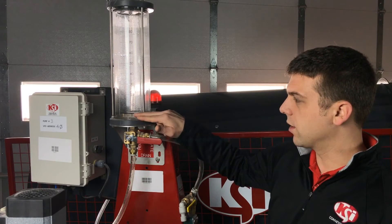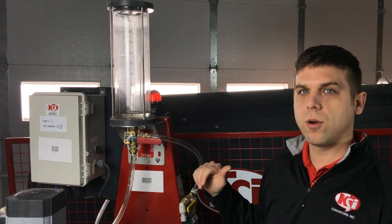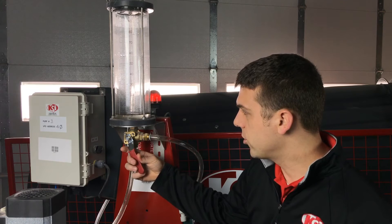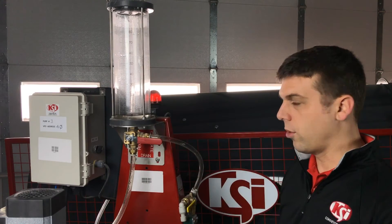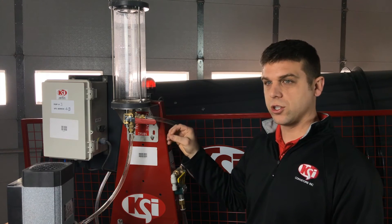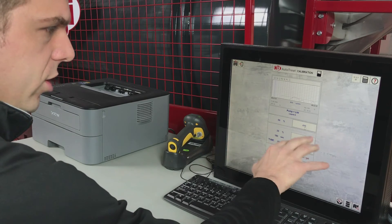On the calibration tube, you can see the liquid is just a little bit above the zero mark. We want to slowly drain that liquid back out of the tube and then put the valve back into calibrate. At this point we're ready to actually run our calibration procedure by pressing start on the touchscreen — we can see the start button in the middle section.